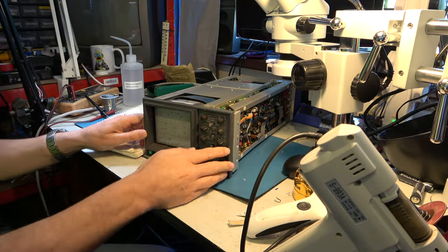I bought a non-working vectorscope on eBay and it turned out to be quite a simple fault — only a blown rectifier in the power supply. I repaired that and switched it on. It worked for about two minutes, then a fault developed in the high voltage circuit that drives the tube, and I wasn't able to fix that despite spending many hours trying. There's a problem with the feedback in there. So this is my first attempt at a vectorscope.